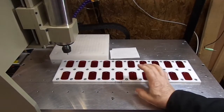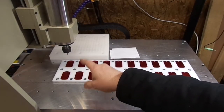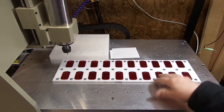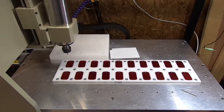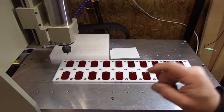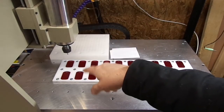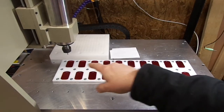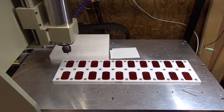We've got 20 tags loaded in. I have the Z-height set and I copied and pasted it on the other 19 offsets in the fixtures tab in Mach 3. G28 safe retracts are turned off and the safe Z-height is three-quarters of an inch, so when it finishes a tag it should come up three-quarters of an inch and move over to the next one. We're going to run this and keep our fingers crossed trying not to crash the machine.